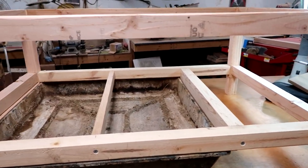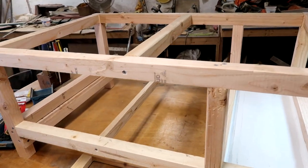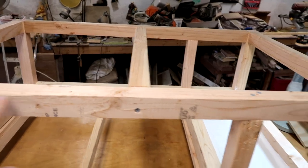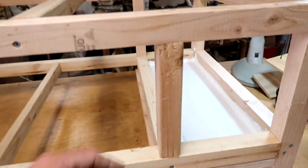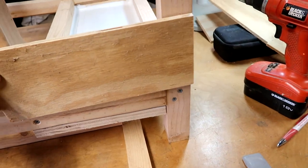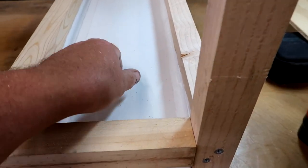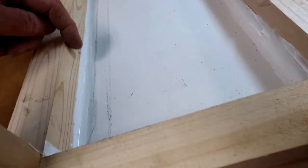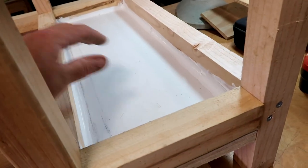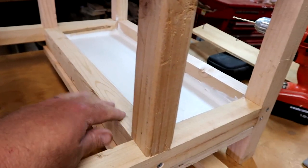I think I'm about done with the woodwork, and I'm kind of calling audibles as I go along. I added a middle bar here just because it's three feet across and I wanted it to be a little stiffer. I added these vertical supports because I'm going to add boards that way when they kick their sand around not too much will come out. I added this floor right here, and just to make sure there weren't any gaps, I did put some caulk around here — sideboard, sideboard, and in the back. You don't have to put sand down here — if you want, put hay or something else for them to stand on. It's just a way for them to get off the wire.